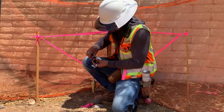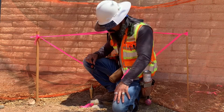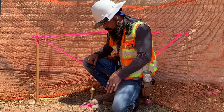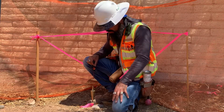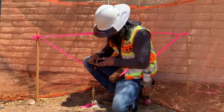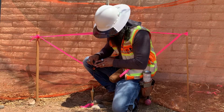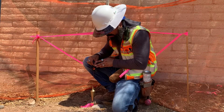You thread the string through the bracket. I'll wrap it around my finger so I have a little bit more control, and that also frees up my thumb. I'll use my thumb to orient the prism so that it's always facing right back to the instrument itself. If I feel like I need a little bit of extra support, with my elbow touching my body so my arms are supported, I'll give an extra hand of support here, steadying my fingers, using my thumb to make sure that the prism is facing back towards the instrument.